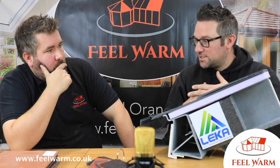So, you know, it's obvious what timber is: a great material, easy to work with, easy to cut, and great for a lot of applications. But in terms of conservatories, no, it's over. And again, moving back to the expansion and contraction rates of timber against what you're putting onto the UPVC frames, UPVC expands and contracts at different rates to timber. You'll get a lot of movement and a lot of cracking on your plaster. It's just not fit for purpose in that sense.